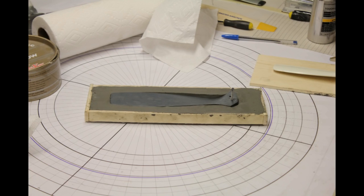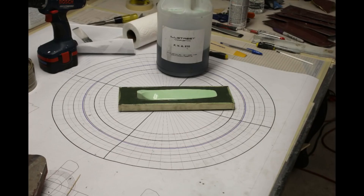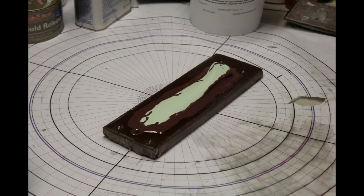Here's where I'm starting to do what ended up being my best mold. I really took my time, got a test blade in there, made an impression, pulled it out, and put in my highly waxed and polished blade. Make sure you build the clay up around the leading and trailing edge and the tips. Then I waxed it and put my PVA on — you can see the prop actually turned a little green from the PVA. Remember a really thin coat of resin first; make sure you build a trough around it so the resin doesn't run off.